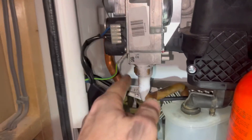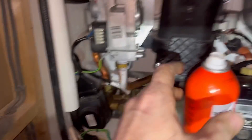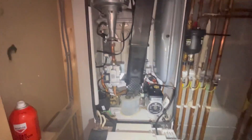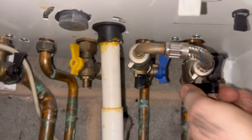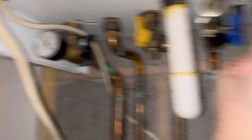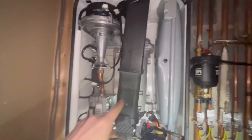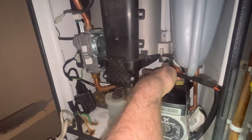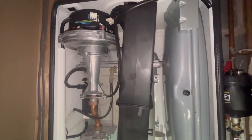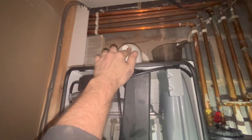Let's get some pressure back in and give this a test. Pressure on the Logic is normally underneath here — just turn those two knobs and it'll get the pressure up. Get it to about 1.5 bar. I'm going to do the gas rate and combustion checks on this. I'll put the analyzer around the back of the sump, just around here, to make sure it is all sealed up, and just around the burner to check the burn seal as well.